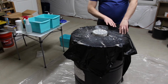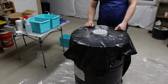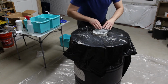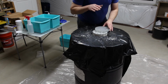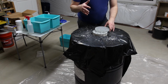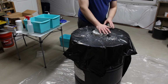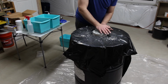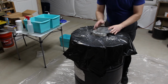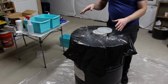And probably going to fix that by moving my strokes a little bit farther into the center as I go, just to try and get it more of a spherical shape. So, yeah, let's see what we can do here. Now, ideally we want more pressure in the middle, again, to help grind it out so that we can get down to that spherical shape, the bottom, at least in the center, down to almost the maximum depth. Ideally, I saw some people say you could put your whole body weight on this. It's grinding fast enough. I don't know if I really need to do that, but I could just kind of put my palm in the middle. And that'll, again, help give it a little more pressure. I believe I read that the silicon carbide works better when you have a little more pressure.